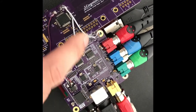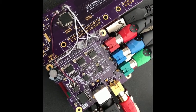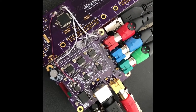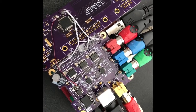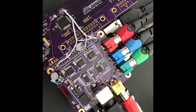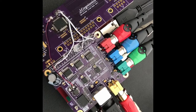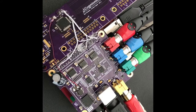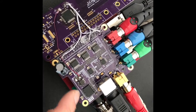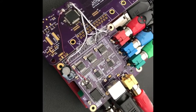But the critical thing is that it's phase locked to the Raspberry Pi's pixel clock. That way I can create a pixel mode where each line has exactly an integer and a half multiple of the chroma subcarrier. Therefore, on every line the color carrier reverses phase, and that allows the TV with a comb filter to decode the color information properly. Whereas in the old design, I had a free running oscillator, and that's why we saw those crazy artifacts earlier in the video. Pretty quick hack, so let's see how it works.